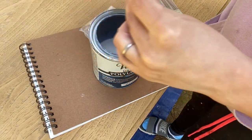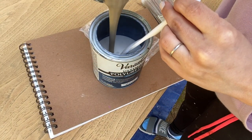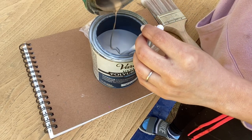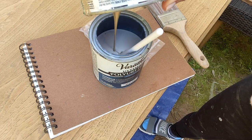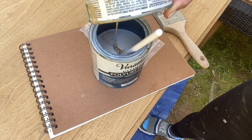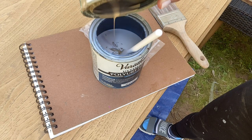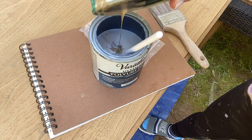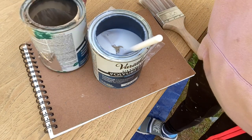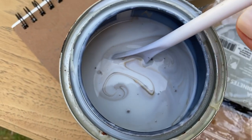And I'm going to do a taupe wash, which you can do with any kind of tan taupe paint that has more of the green undertones, because you want to think about those green undertones canceling out the yellows and the oranges, the red tones in your furniture. And you can do this with water, or you can do it with a clear coat like I'm doing. I think I like the water way better.